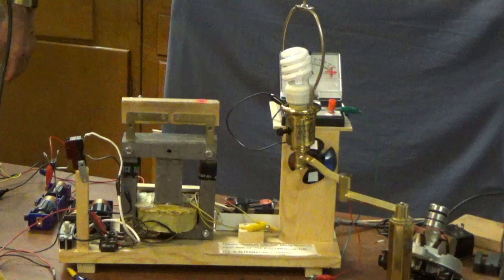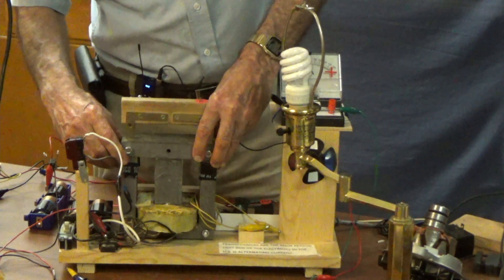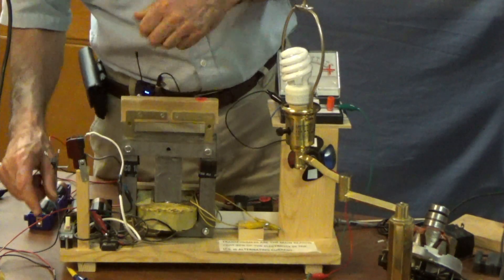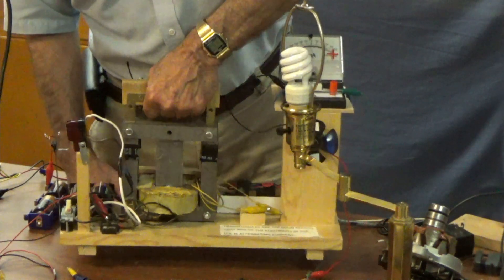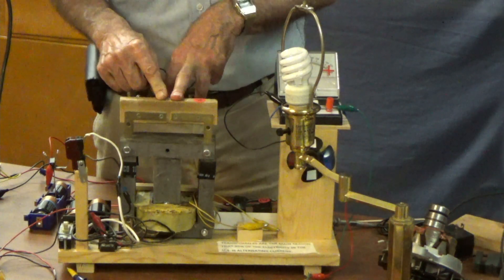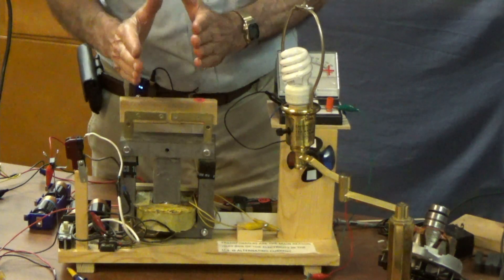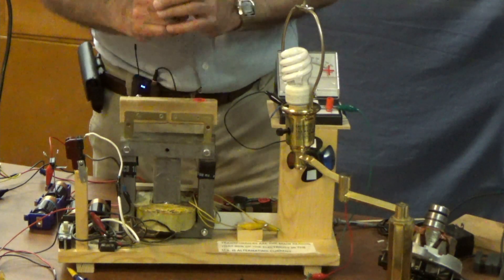So let's take a look. Right now there's no power on. I'm going to turn the power on — nothing happens. Three volts is not going to light this bulb. The power is on, and when I turn it off, watch the bulb — it flashed. Turn it on, nothing happens because three volts won't light that bulb. But when I turn it off, the magnetic field collapses so quickly it produces a short pulse. We're taking a long time to create the magnetic field and a short time for it to collapse — relatively slow building up and very fast as it collapses.